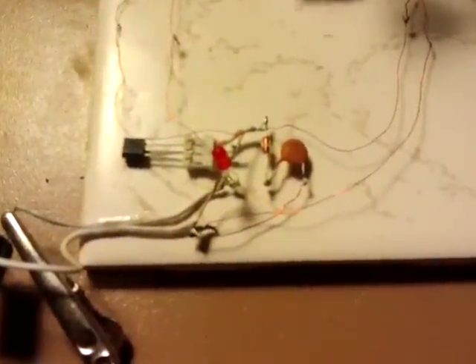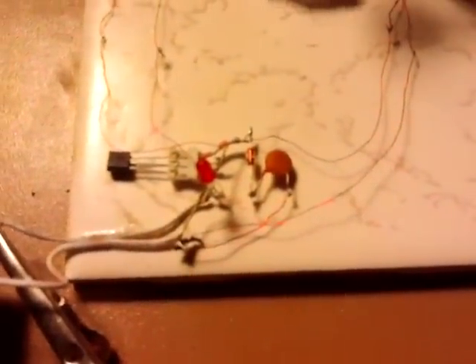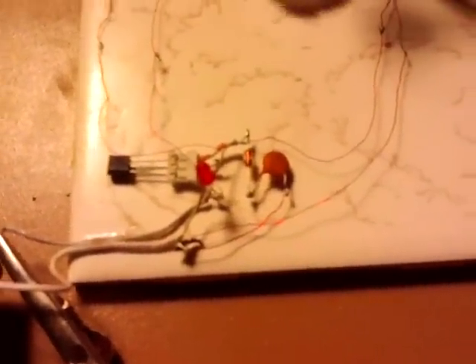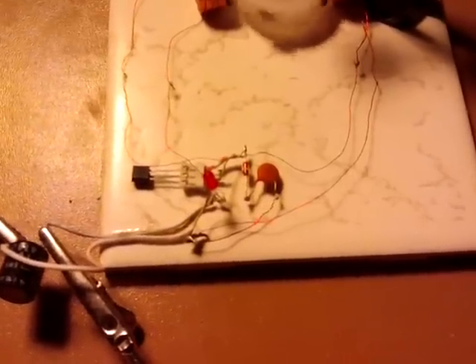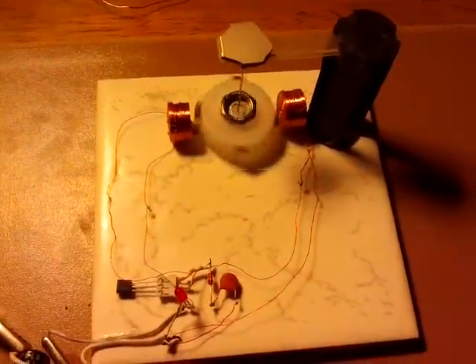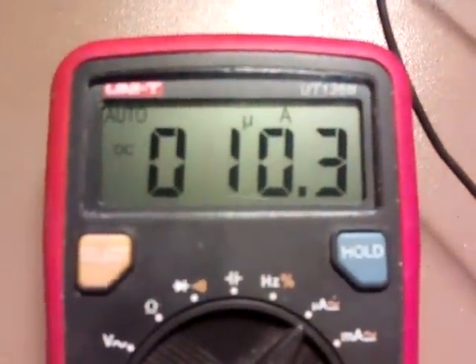I've done a small change to Lidmotor's circuit from the collector. I've got a diode and then in series with that I've got a 0.1UF ceramic capacitor. If you put directly the diode across back to the positive of the power source, it'll kill the motor. But this way is more like audio systems where you can isolate the returning power. The point of all this is that it's running from about 1V — almost exactly 1V — and it's using 10.3 microamps.